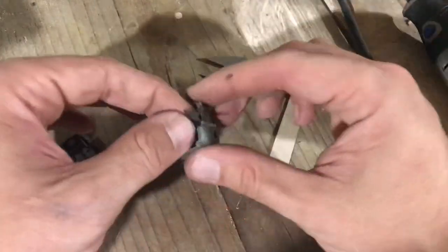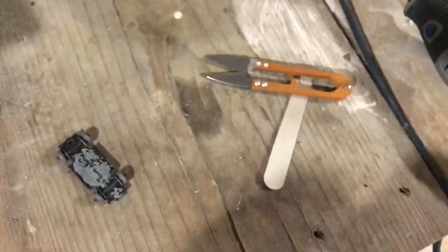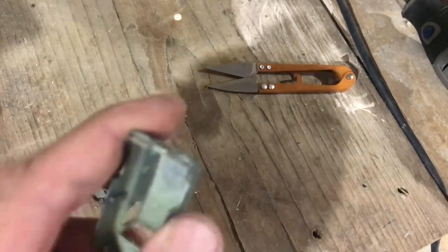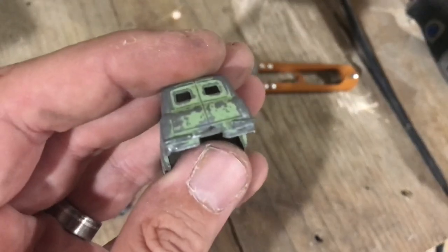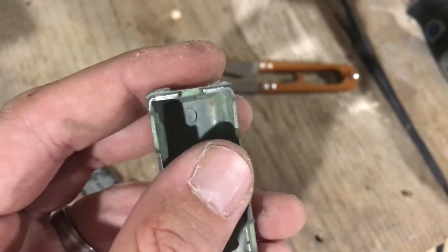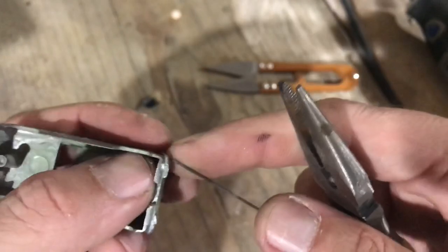And what I'm finding is that the JB Weld is just too soft. There's not enough of it there. Every time I tug on it, it just breaks loose. So the attempt to repair with JB Weld by itself was a total failure. I think I'm going to have some other type of reinforcement in there.